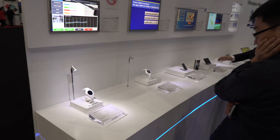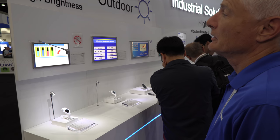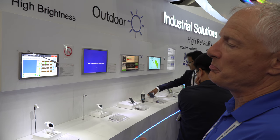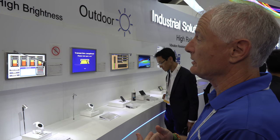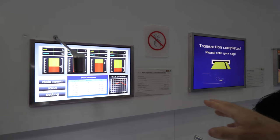What you see on the walls are our outdoor viewable products. This is a combination of taking a standard transmissive display, adding a backlight recycling film to push more light through the display, as well as a proprietary AR coating on the outside. Most of these straight out of the box are 1600 nits with 800:1 contrast ratio — so outdoor viewable.